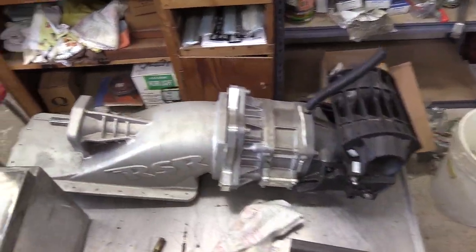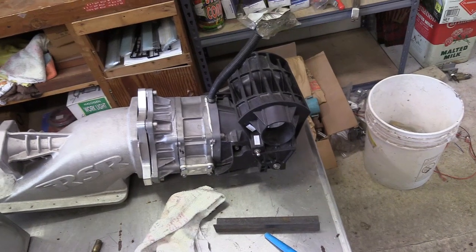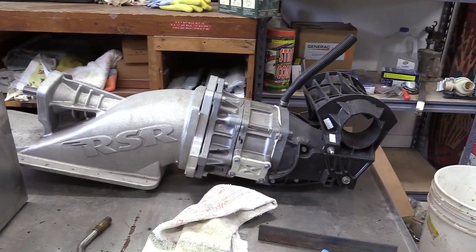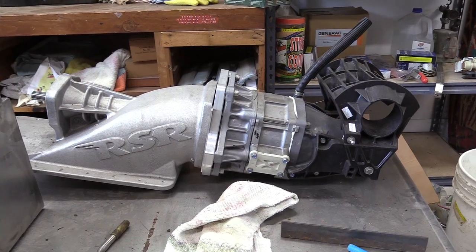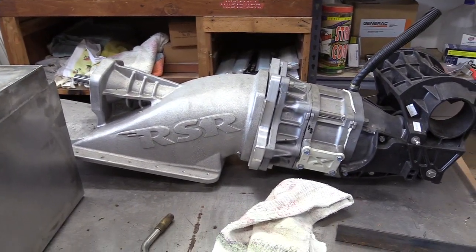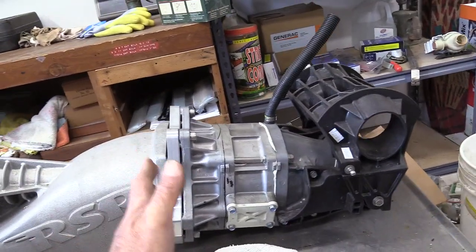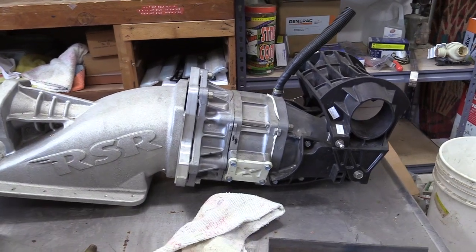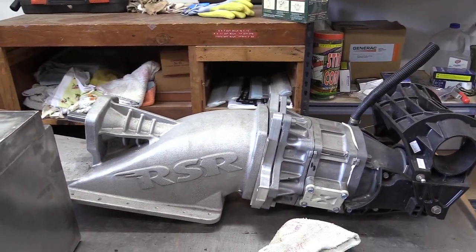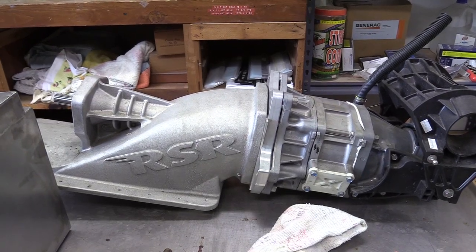This is the jet pump and intake. I bought a shortened drive shaft and the intake. My big concern is they say there's going to be very little clearance between the engine and the bottom of the boat. When you mount this intake, there's a ring that goes into the bottom of the boat that the intake mounts to. The intake has to match the transom angle and the bottom of the boat. If you have an eighth-inch clearance with the motor I'm using and you get that off just a little bit, it's not going to fit.